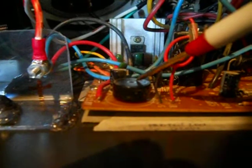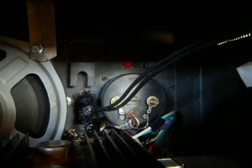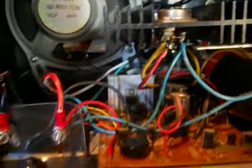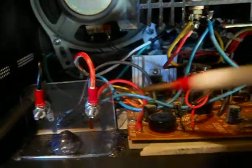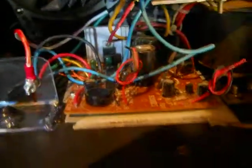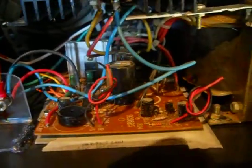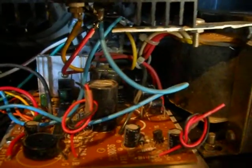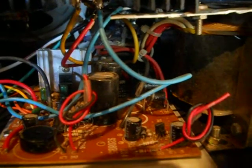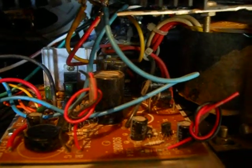Here's my little squealer in case you short-circuit it. You have a diode when it's on and short-circuit protection — it'll light up. That little red light above the meter: I'm going to try to find a diode, and I've done it before testing it. I'll jump across it real quick, make it squeal and see if the diode will light up. I do have some but I don't know where the original ones are. The other one just shows the power on. I have a real small bulb with some blue stuff over it so it glows a blueish color. That will dim down as you draw on the power supply — it's just as good as having an amp meter. If that light starts going out, I'm overdoing the power supply.